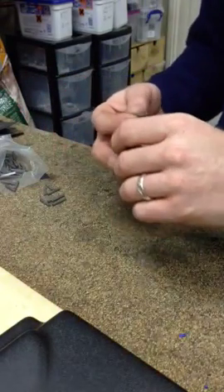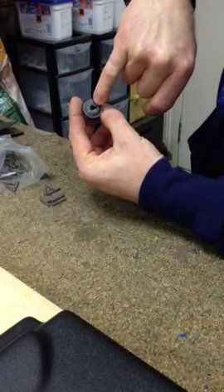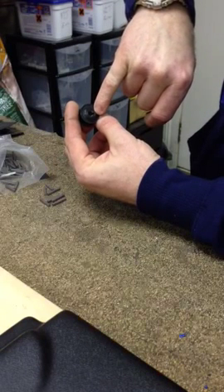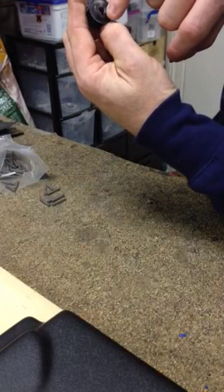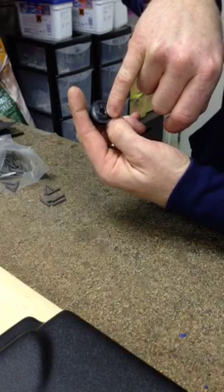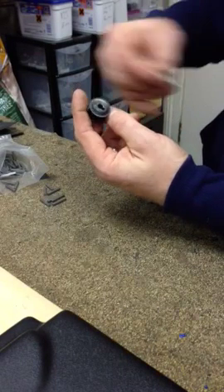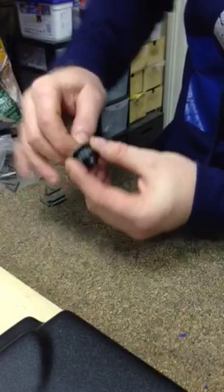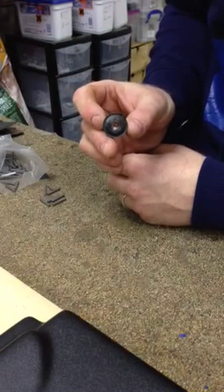The only things I have found with a couple of pulleys sometimes is that the keyway slot in the actual pulley can be a little bit tight, or has got a small burr on it, or sometimes — as you can see there — it's not quite square. These come from a manufacturer; I get 50 of them at a time. So the first thing to check is to get your keyway and just slide it inside, and check that it slides down there easily. So that sits in very nicely, slides in easily.